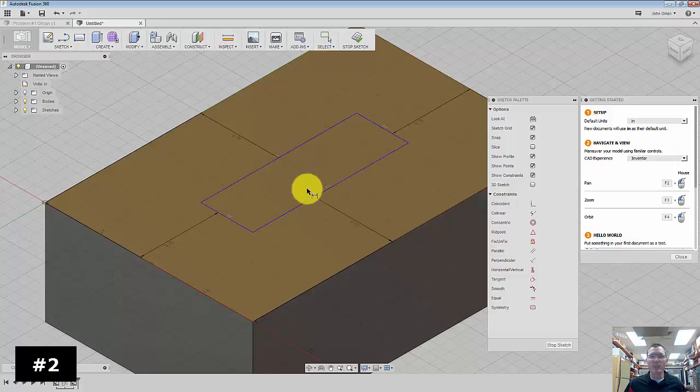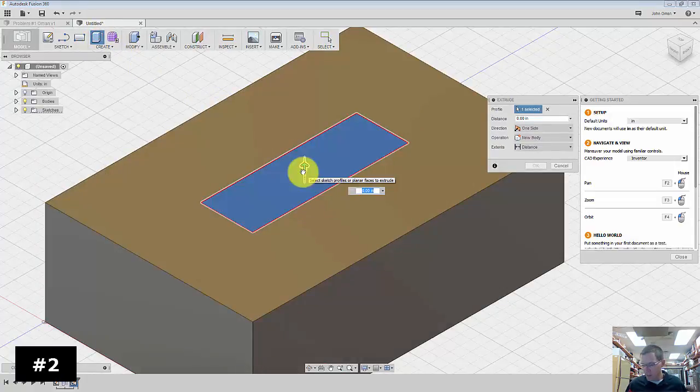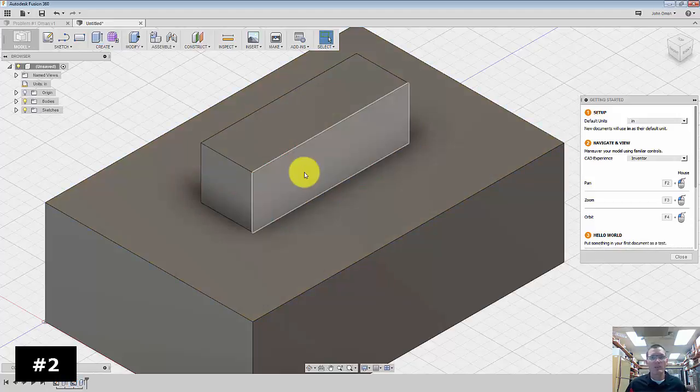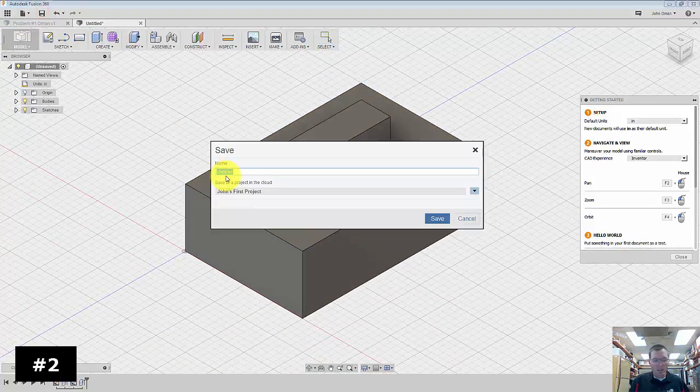Okay, so if I did that all the way around, my 1/2 inch should be here, my 1.5 inches should already be correct. You don't need to even dimension that anymore. It's already done. It's there. Okay, let's just simply extrude that surface, and that's going up 0.5. Enter. And problem number 2 is done, so please save that.